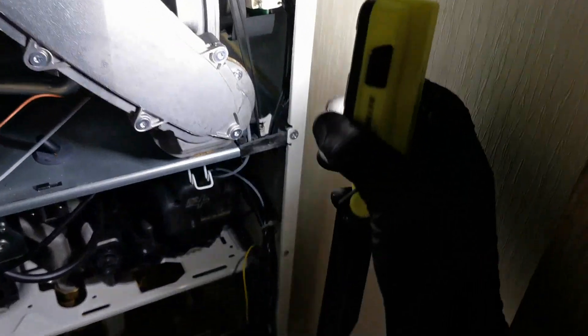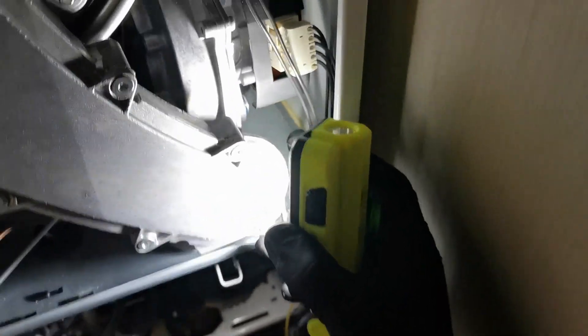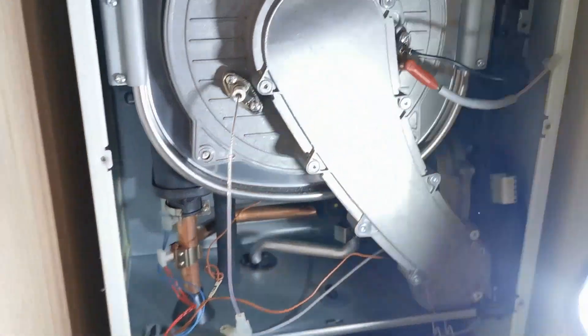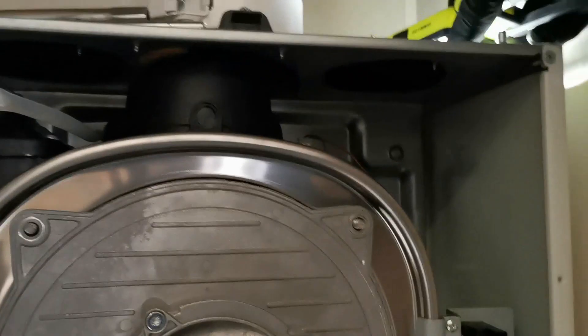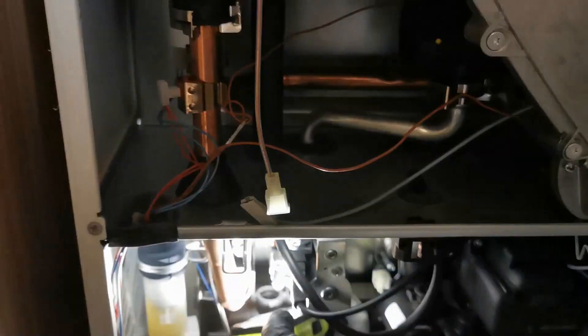Get your torch out — I've got the UniLight one here, great make. Just going to shine it on all the seals, make sure it has made a good seal. I also like to run the torch around the case, all four edges, to make sure I can't see daylight on the inside. If you can, then obviously it is not room sealed.